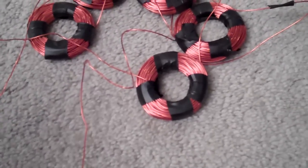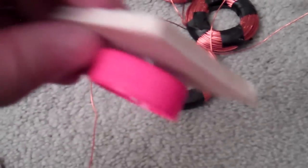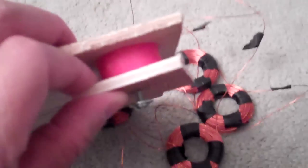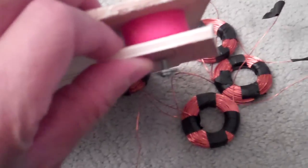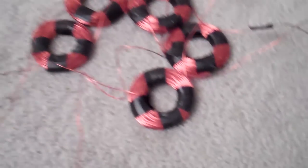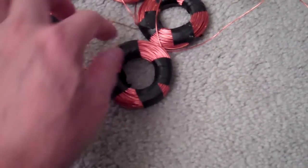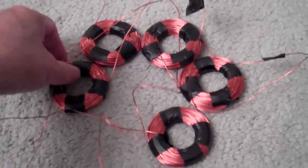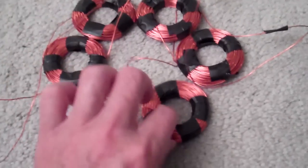I made an extremely simple jig out of a bottle cap, then just screwed it into a piece of wood — I didn't even cut a slot. After I wound the coil I just slide it out and put electrical tape on it to tighten it, and then I will cast it into the stator.